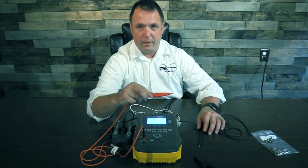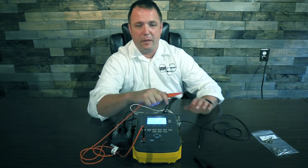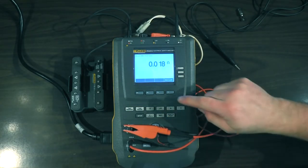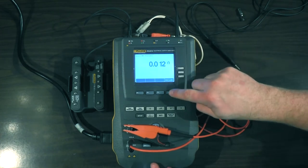This is going to go to the ground stud. If you've changed the cable, lost the cable, forgot the cable, or had to use some other cable, what you can do with this is start off by going to the ground. We're going to ground our resistance and we're going to zero our cable out.